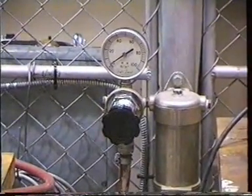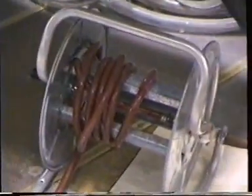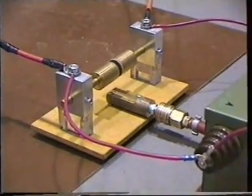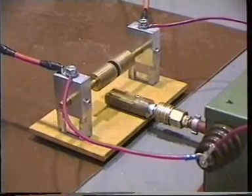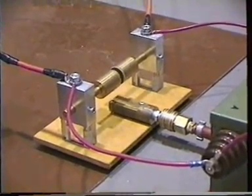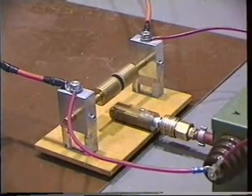What we have here is our air supply. When the Tesla coil is running I have this turned up to 80 psi. It comes down to there, and if we follow that through — there it is — comes down to here: the spark gap. So the air supply feeds right under the gap electrodes there. It introduces fresh air into the gap to try and remove some of the ionized air from the spark, which helps the gap quench properly. Which is a desirable feature of the coil.